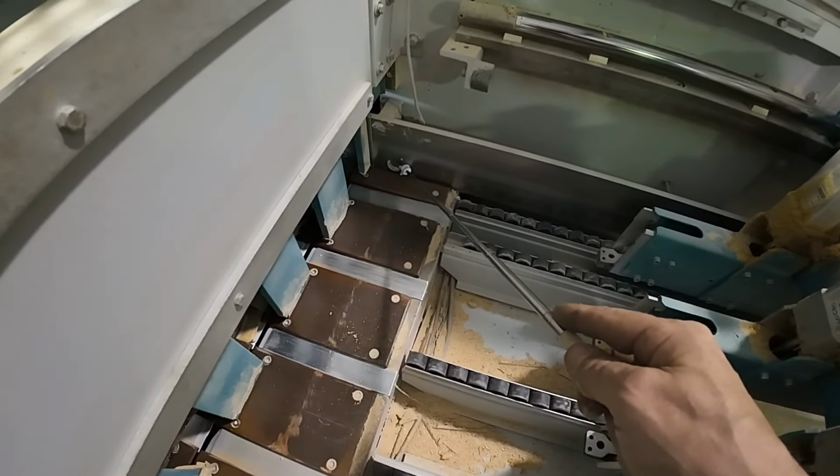Okay, so what happens is, let's say that I tell the machine that I'm going to do a pullback on a part that is 96 inches long. The pusher goes back however far it needs to go to accept that 96 inch piece, or maybe it's 84 inches, whatever that value is. But if I introduce a part that's wrong, so let's say I put in a 60 inch piece instead of a 74, or I put in an 80 instead of a 96, what will happen is the short fence that's in the back, the squaring fence, when the pusher pulls back, it comes off of that sensor, and because it's off that sensor, when this comes forward, this is disabled. In this scenario, that sensor always thinks there's a panel there.